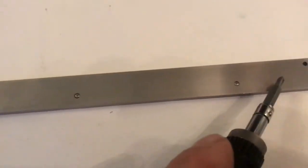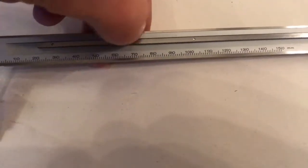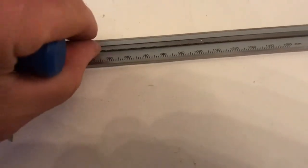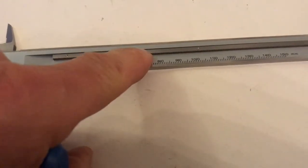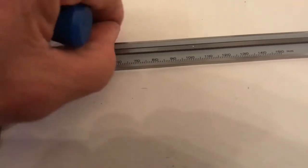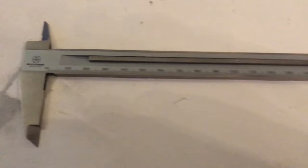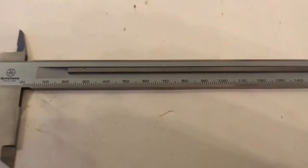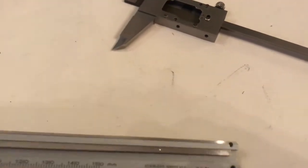My experience tells me to put all three screws in loosely first. Then you can go along and tighten them up while keeping your nail in there to pull that bar up. There's a very small gap you can have — if it's not right, the rack presumably won't be quite straight and it'll be tighter in some places than others. I'm going to tighten up. Look — there's no gap along that edge, so we know it's right. Put those two together loosely.